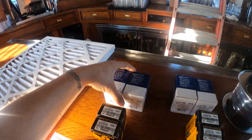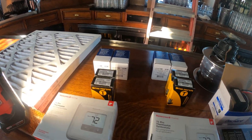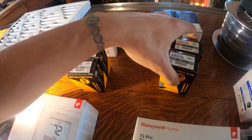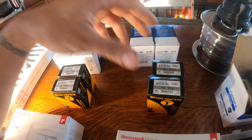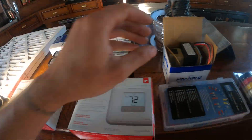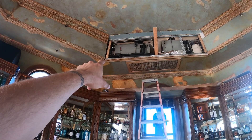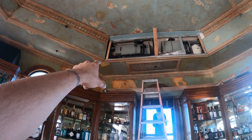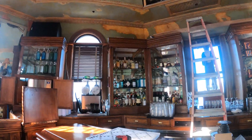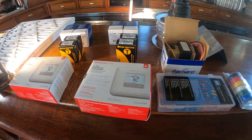Inside we're going to use a contactor and a transformer, and outdoors we're going to put a new contactor. I do have the capacitors — two 10-microfarad for the indoor and 5-microfarad for the outdoor. The transformers we're using are going to be universal. This one I installed the breaker type where the previous one was fused, so this one's ready to go. We're going to install another transformer and contactor there — pretty much just a bunch of madness today.